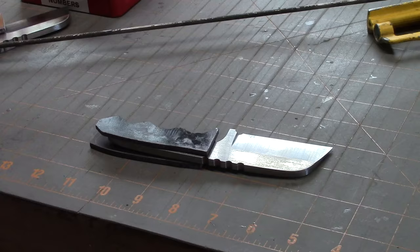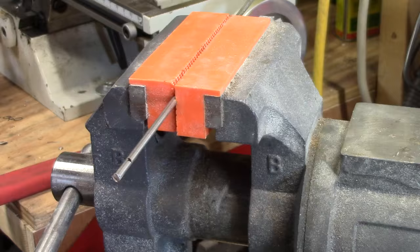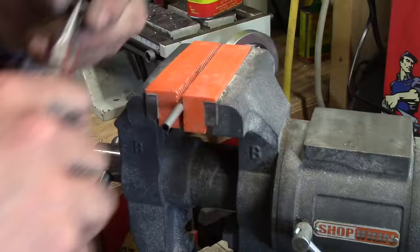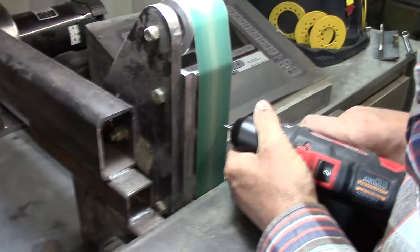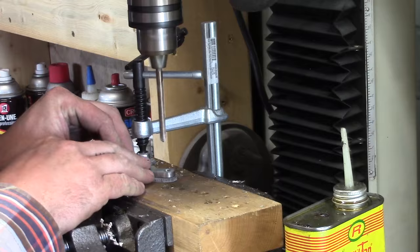We'll profile and cut out our scales and get them roughly ready for pin drilling. I'll measure my pin length with all the material stacked and then cut those pins out. The pin is tool steel, and the tube is actually — I think it's a brake line. I like to deburr them on the belt grinder with a drill — a quick way to knock the edges off so they don't hang up during assembly.